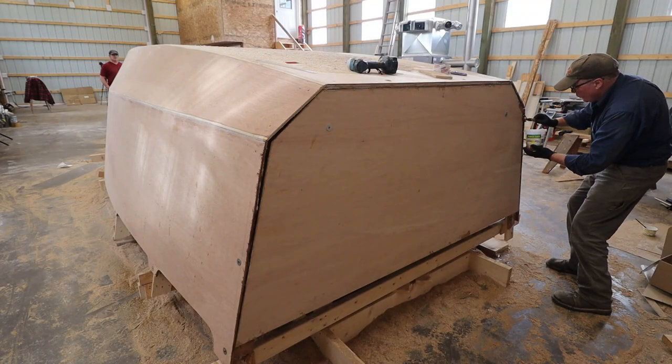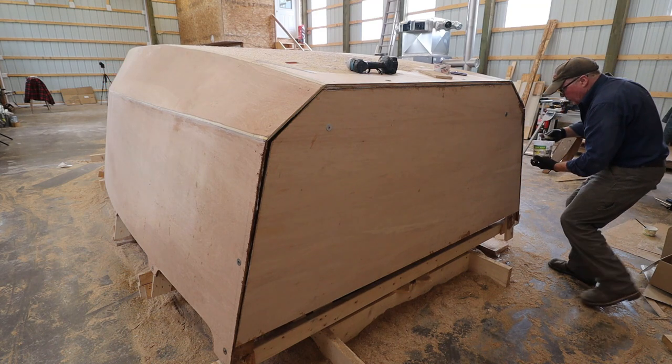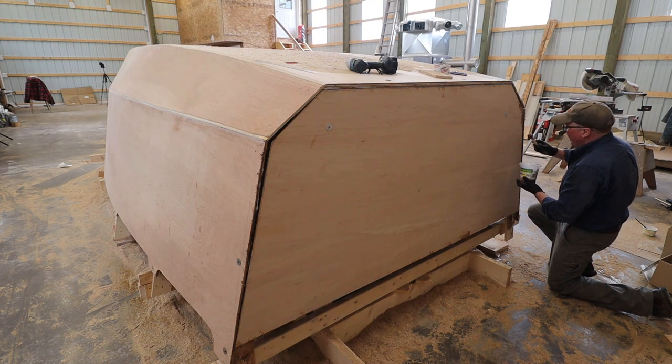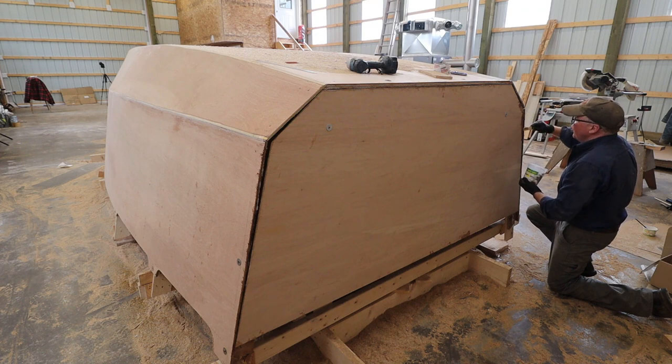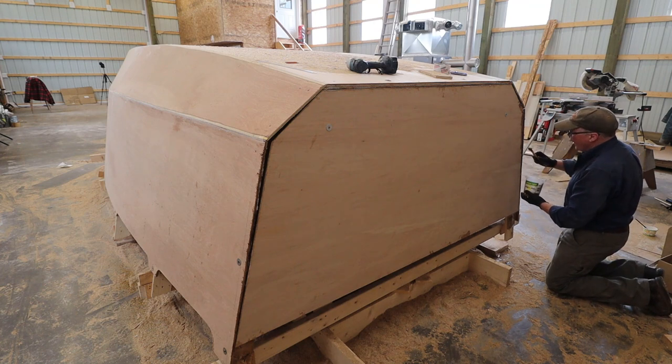Is that a special mixture? It's wood flour and microfibers. Okay. So the microfibers are basically chopped up fiberglass. Right. So it's quite structural when the epoxy is mixed. And wood flour is just fine sawdust, like from a sander. Right. So it's, you know, wood is what the whole boat is made of. So yes, between wood, epoxy, and the fiberglass, it's like a wood product, a composite.